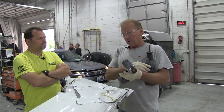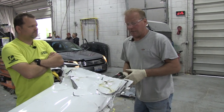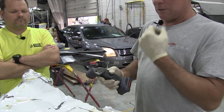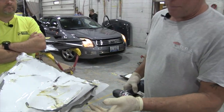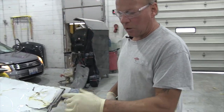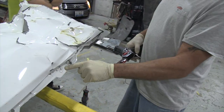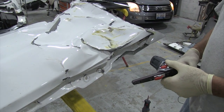When they see this, they're going to all be fighting over it. One of the main reasons they use this is to clean spot welds — to weaken a spot weld to separate it for replacing a part. Say if I was going to weld this outside panel on, if this was a quarter panel on a car, we have to break the welds right here. These are spot welds. We have to break those, and to break them, you have to weaken them.